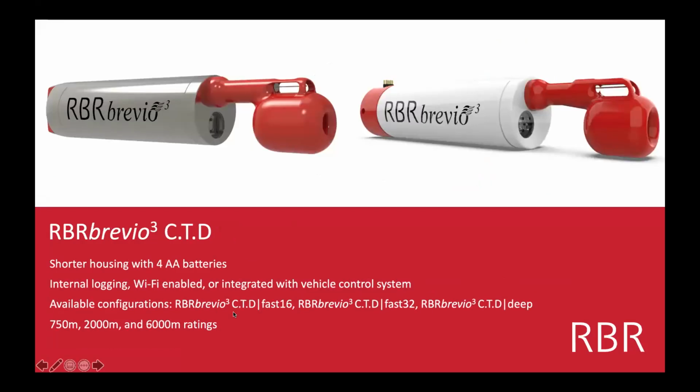Another version of the CTD that we have is called the Brevio. This is a little bit shorter than the Concerto. Instead of holding 8 AA batteries inside, it holds 4 AA batteries inside. And again, it can have internal logging, it can be enabled with Wi-Fi, or it can have a direct connect through a cable at the end, which could be used on some vehicles to either control it or to provide feedback to the vehicle itself. Again, it can be configured with fast versions and with deep, so with a titanium housing.